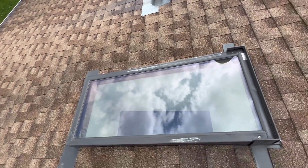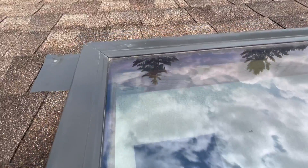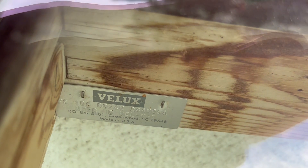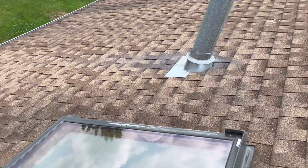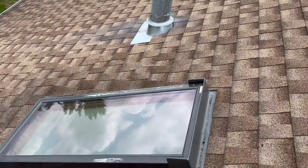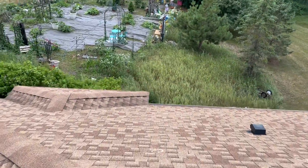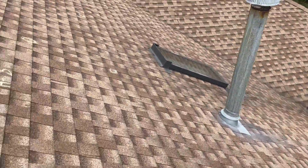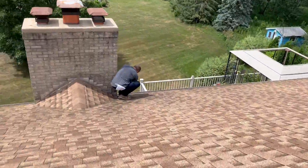You want to try and find some brand markings. If you look here, on the glass you've got a little Velux decal. And if you go down here — this is really what you want — there's a serial plate. That'll have the serial number and the model number on it. If you can ever find that, it's the easiest way to get a nice, perfect order because you don't want to order a skylight that's the wrong size. We're going to get some elevation down on the ground and do a window diagram.